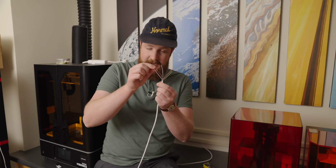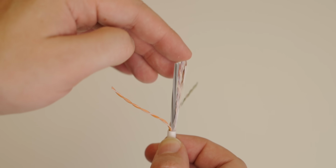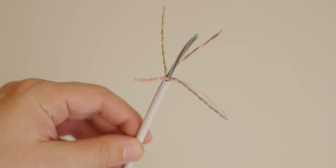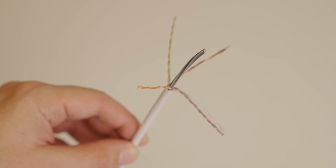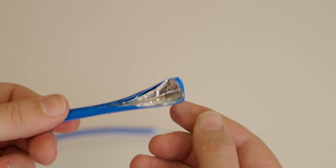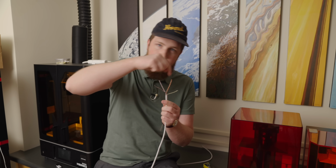And that's because inside there are 4 pairs of wire, 8 conductors in total, a little plastic splitter right here, and a little piece of yarn that allows us to pull the jacket. But that's it. It's unshielded. It's just there. Newer generations of cable, like Cat6a and later, are referred to as FUTP. They're the same except for they have foil wrapped around the pairs themselves and then around the entire jacket.